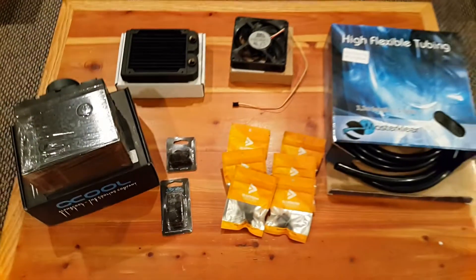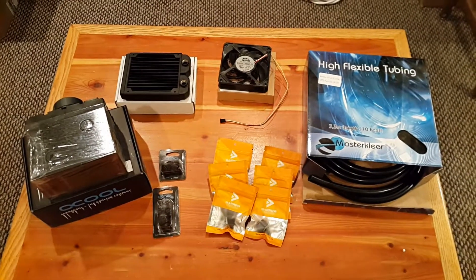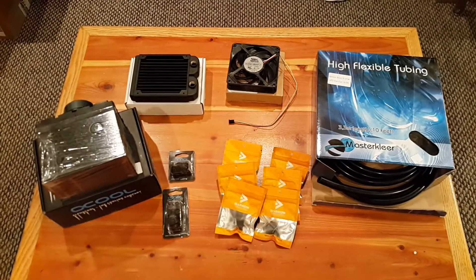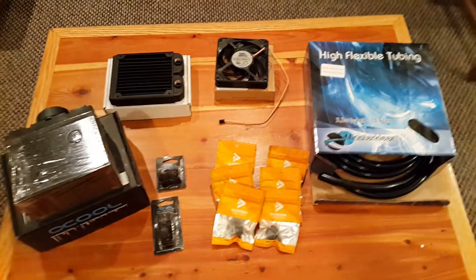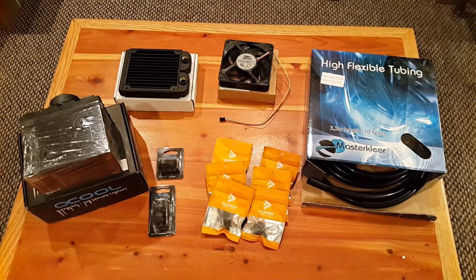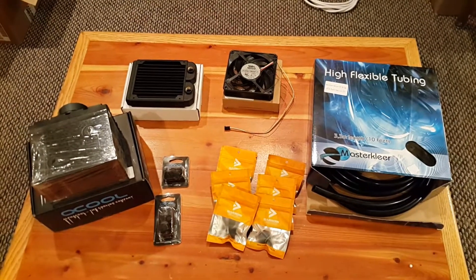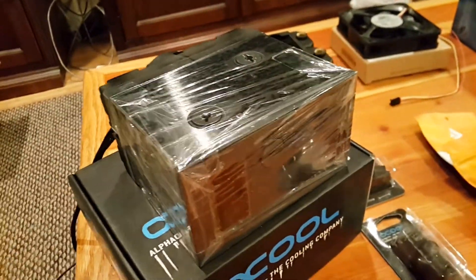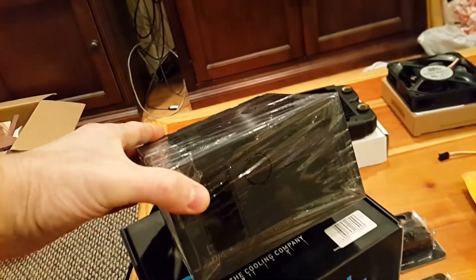With that, it requires us to make a cooling system, and so these are the parts I've selected. These are parts for cooling CPUs and, by definition, are ridiculously expensive. I tried to keep it as cheap as I could. You could save a lot of money going the aquarium pump route — there's a seemingly reliable Chinese water pump available at 12 volts — but this is the route I went. I chose this Alpha Cool reservoir and pump combo, which is a double five-and-a-quarter drive bay reservoir.